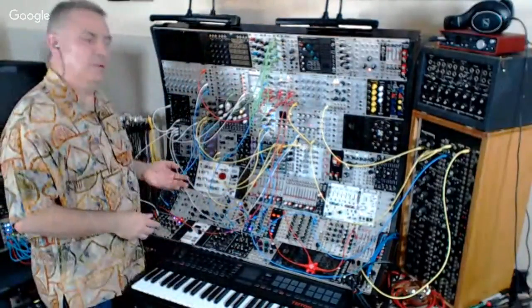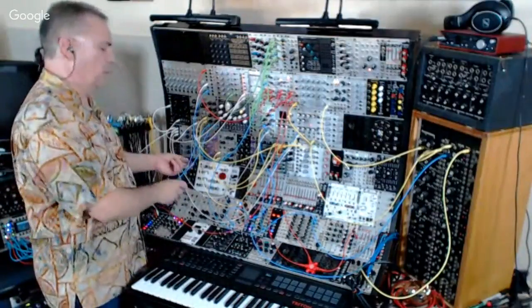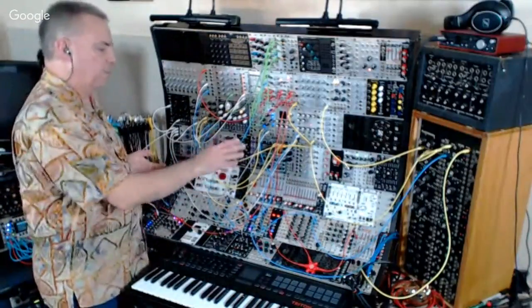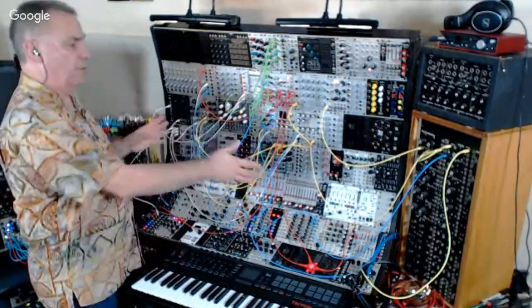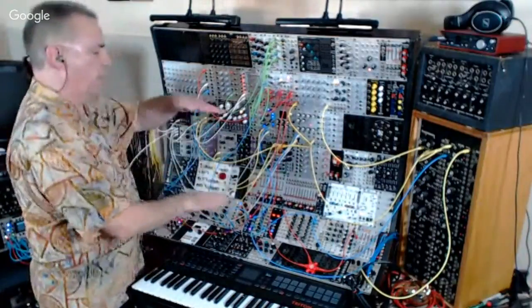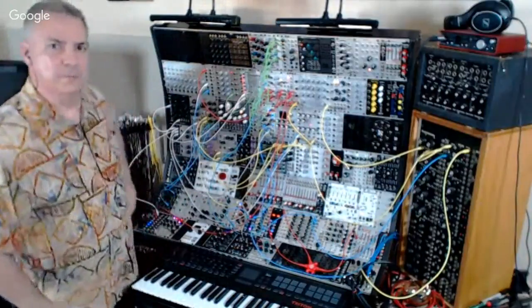And you use every crisis as an opportunity. I use that crisis to put in larger switching power supplies that basically doubled the capacity. If I'm willing to make the regulators get hot, I can probably deliver 12, maybe even 15 amps on a power supply rail in this guy. If you look at Modular Grid, this system is taking less than 7 amps. So I know I have lots of headroom. I'm a big headroom guy, so I feel very comfortable with the system. Yeah, cool.